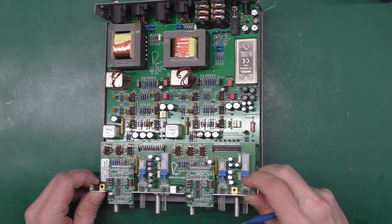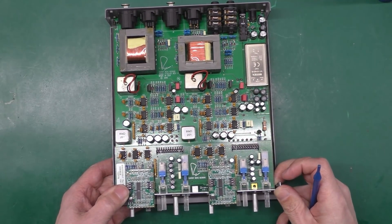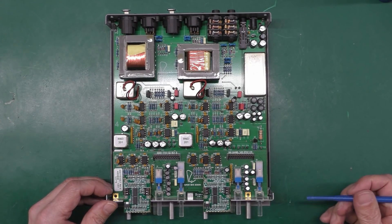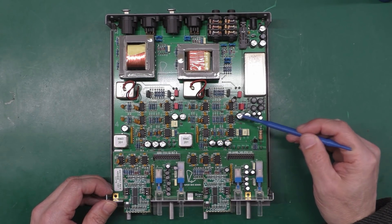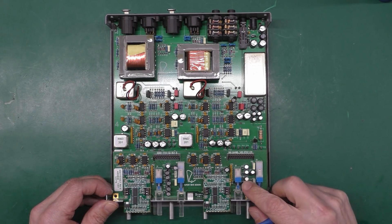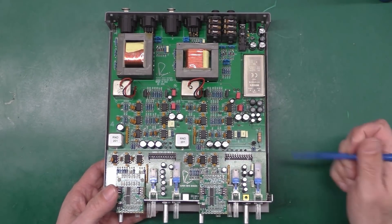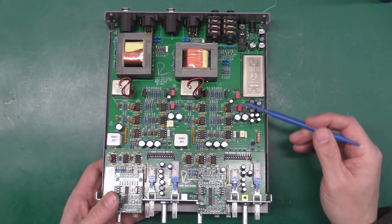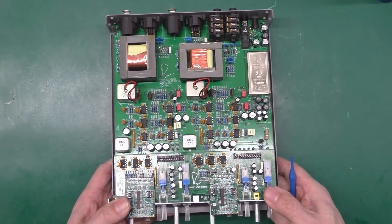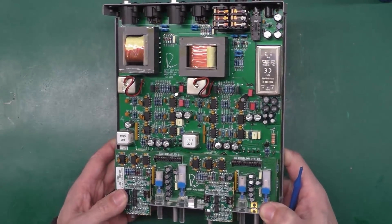There are some smaller caps here — not sure what size they are. I think I'll take the circuit board out. I'm going to replace all of the larger caps but not the smaller ones, as I presume those are signal caps while the bigger ones are across the power supplies. I can't see any other regulators, so I'm wondering whether the plus-or-minus 18 volts is dropped down to other voltages for various parts of the circuit. There could be something underneath the daughter board, so let's dig deeper.